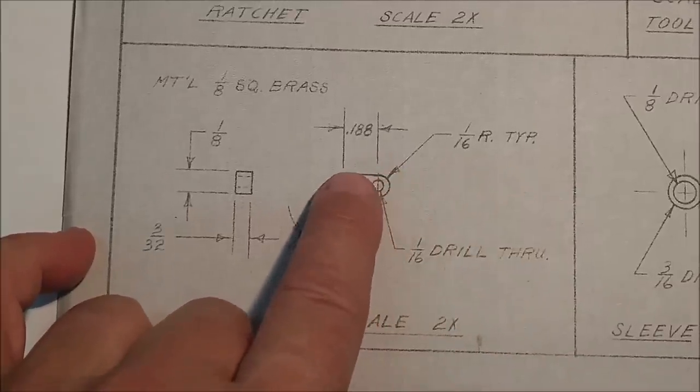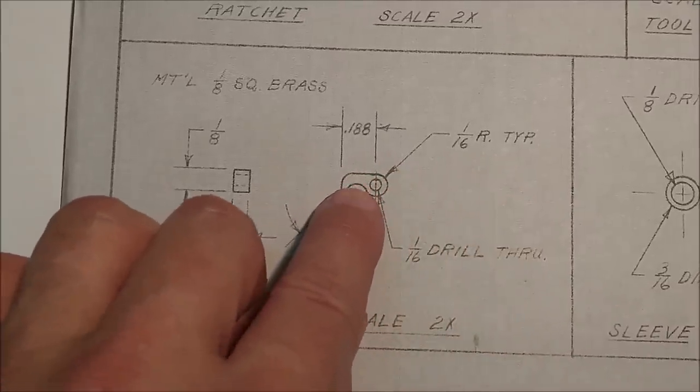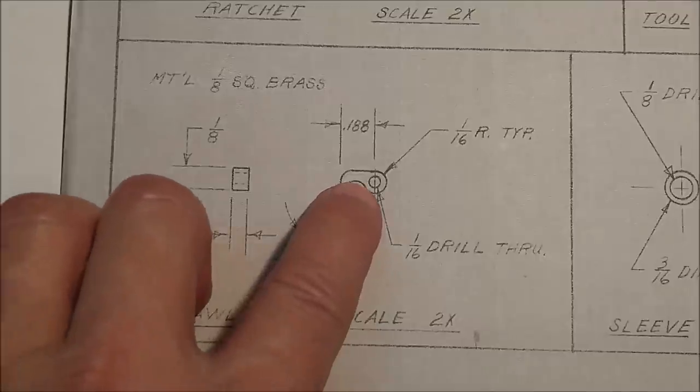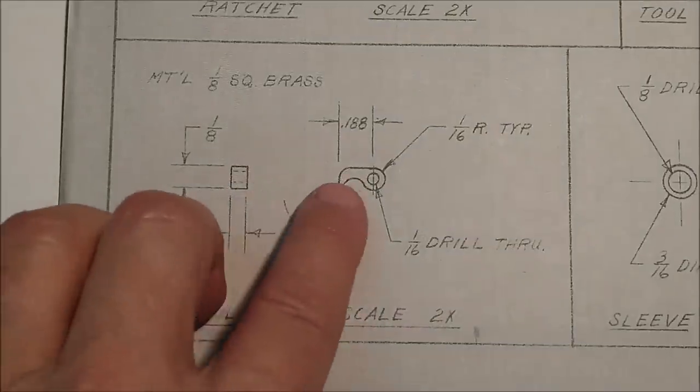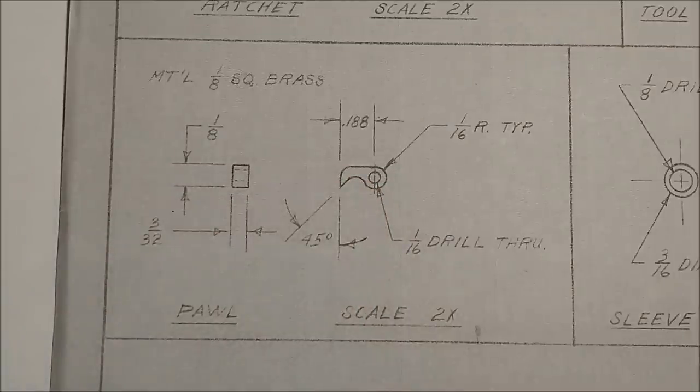That could mean here, here, and both of the inside corners. But actually, you really can't do that right there because they would overlap and it may be an issue. So you have to go a little bit smaller on the inside, 50, 45. For the mill demonstration, these are going to be 37.5. I'm going to use an end mill that's 75, the same way I did on the CNC.